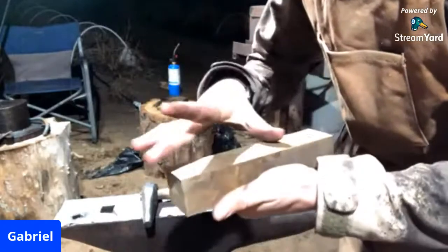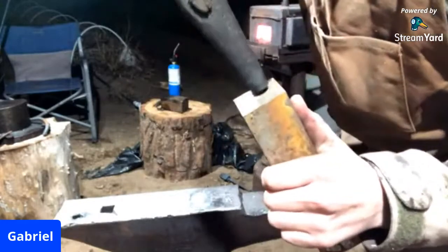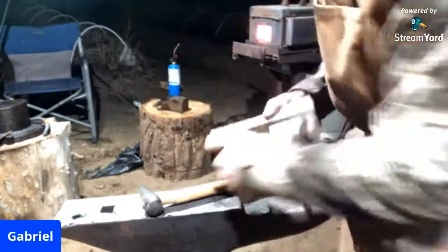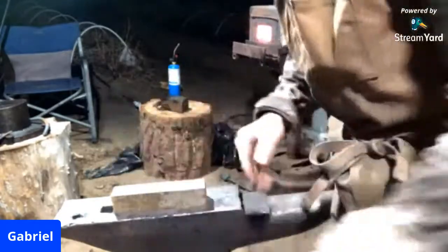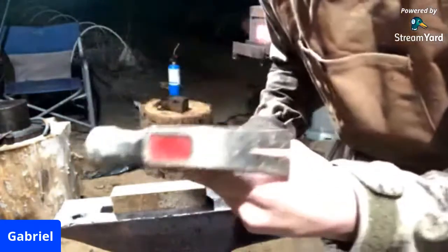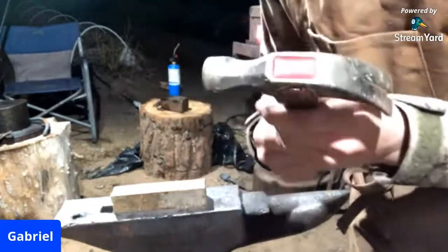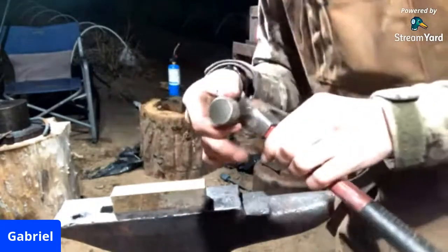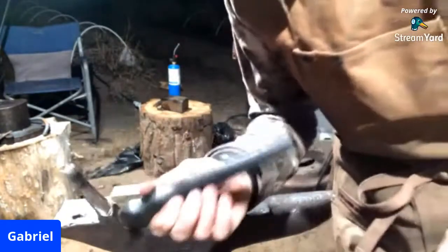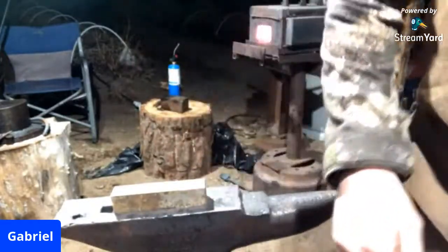And you know, this 4140 size to the punch, I don't know if you can see that at all, it's quite big. We're going to be forging this down a little more skinny for the claw hammer, because it's not going to be too differently sized than this, but it's going to have straighter claws and a different striker. The other punch I can use is one of these punches, but I don't feel like doing that right now.